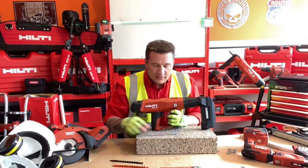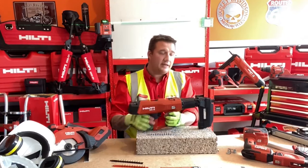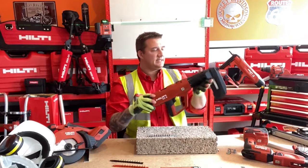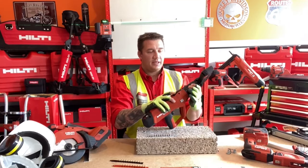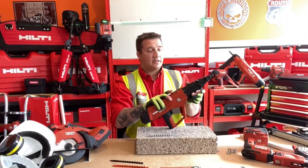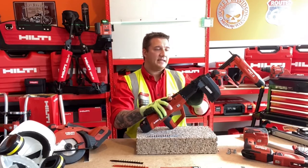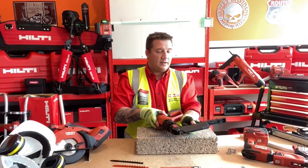The cartridge goes in as normal. It's got the same piston principles and safety features for unintentional firing — you need that depression first before the trigger will press. To set the power with this one cartridge, at the front there's a swivel section with numbers one through eight all the way around. You simply press the button and move it up as required to get the right power setting up to eight. It's also got a far easier cleaning mechanism — simply pull it around and it pops up, no more screwing. Then just clip it back into place; the magazine head comes off a lot easier with a one-click button.